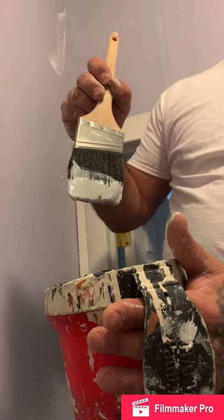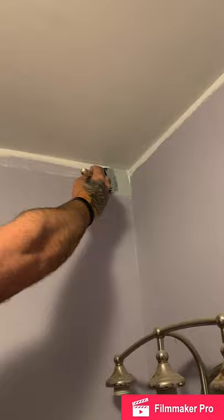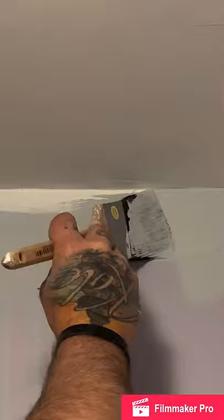I'm going to do the same thing I did before — dip my brush into the paint about a third of the way and wipe off the back side. Notice this brush is angled as well, so I'm going to put the pointy angle up towards the sealant. I'm going to point the edge in there and get as close as I possibly can to the sealant without touching it, working my way in one line all the way down. It's not as easy as it looks — you might want to take some blue painter's tape and tape off the edge of the sealant. But I've been doing this for quite some time and I'm pretty good at cutting in without using tape.